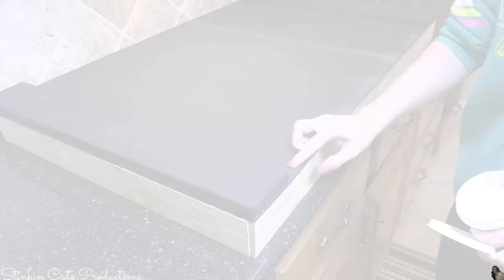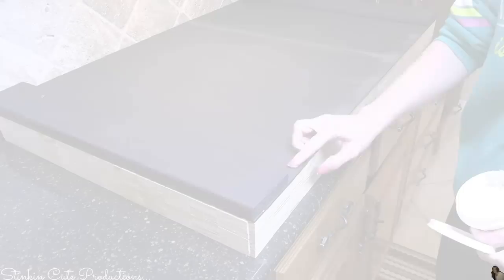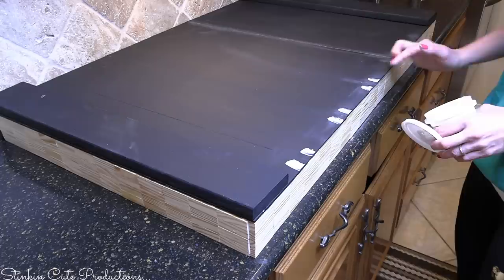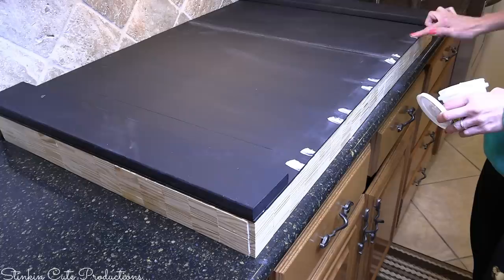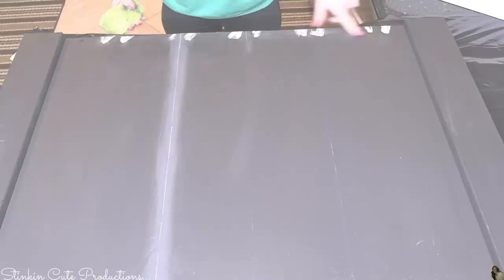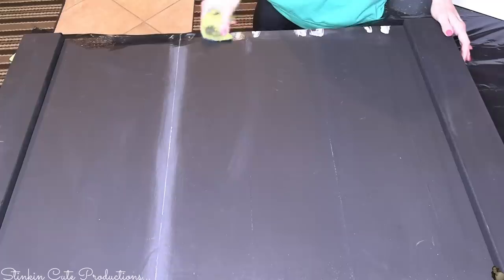My plaques are already painted because I got a little excited ahead of time. Since this piece needs to dry, now is a good time to fill in the holes that the plaques originally had. I'm using Dollar Tree spackling to fill in those holes. What's great about spackling is once it's dry, you just take a wet sponge, wipe over it, and the excess comes right off — leaving you with a nice smooth surface.